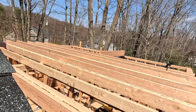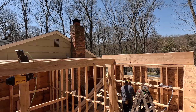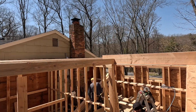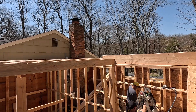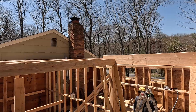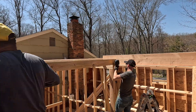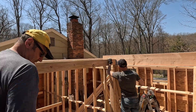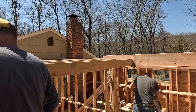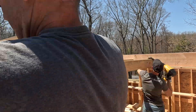We got to the point of doing the joist hangers and the header. Over on this side you can see the two-by-ten header, and now we've got some cuts to make and joist hangers to tack in. As you know from the previous video, joist hangers are not fun. This was one of the few occasions where I was able to use the positive-nailing framer nail gun for most of them — didn't have to use a hammer the whole time, which was kind of nice.